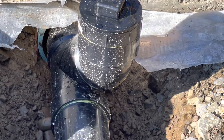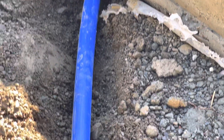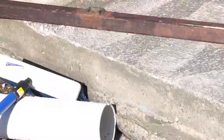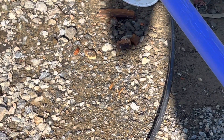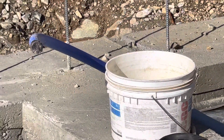The one thing I found worked really good for my under-slab piping is this tubing — it's 200 PSI, and in BC you require a compression fitting at the end of it. This blue pipe is actually a water drop for your well. It's 200 PSI rated and you can actually get a compression fitting at the end of that. That is one thing the inspector is looking for.